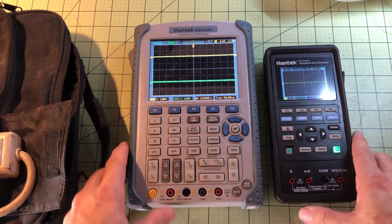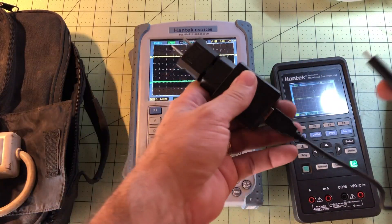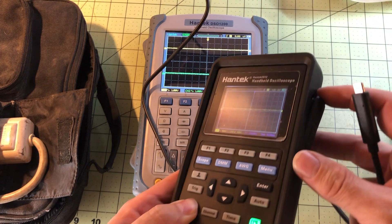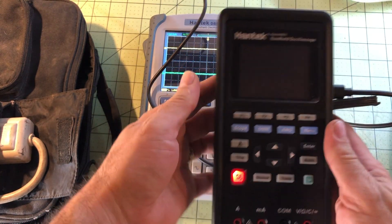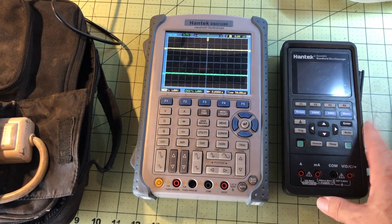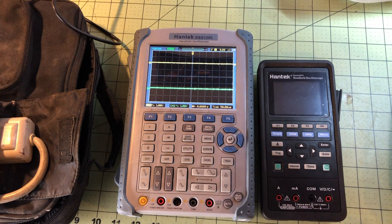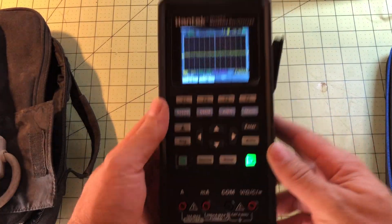When you're using this, you don't want to plug it in. When you charge it, turn it off — the charging port is in there. You can charge it overnight, that's fine, but when you're using it you have to use it unplugged from power. It basically isolates the scope from the equipment you're working on, so it protects the scope and protects your equipment. That's a very important thing to remember.